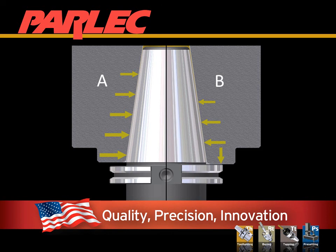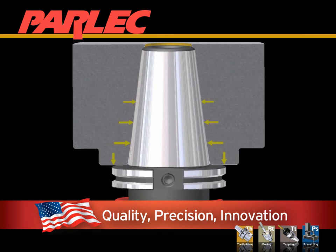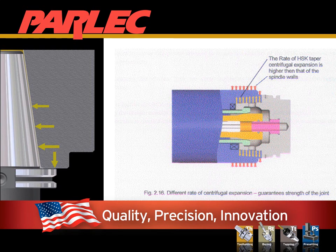We should also consider the wear of the spindle. Restricting the travel will restrict the pattern of wear. To help reduce this wear, consider using standard tooling in a Big Plus spindle where the added stiffness will not provide value. We can also assume that since less of the spindle has been expanded to meet the taper, it will take less spindle speed to begin to separate the connection due to centrifugal forces. The hollow taper of the HSK connection is designed to expand with the spindle at high operational speeds. SimulFit steep taper is not necessarily a good substitute for high speed, high performance operations.